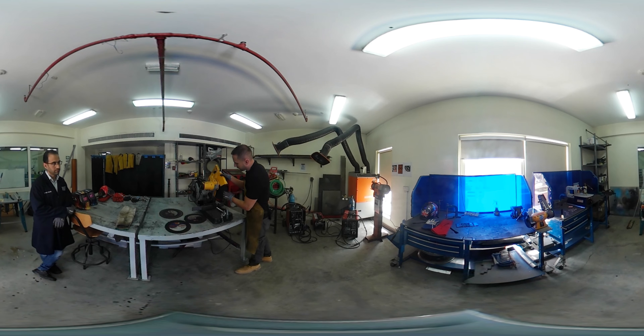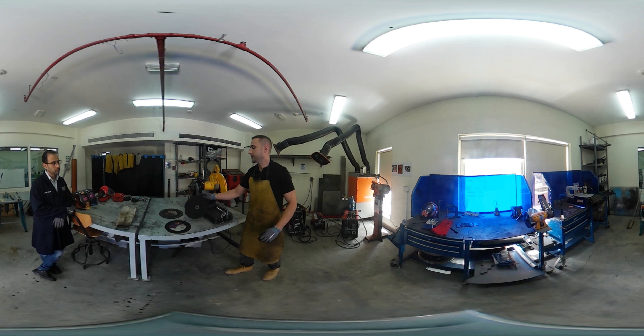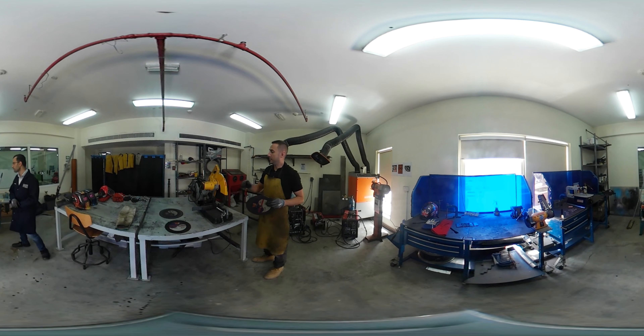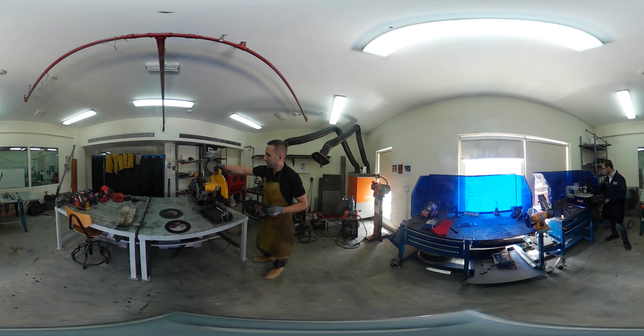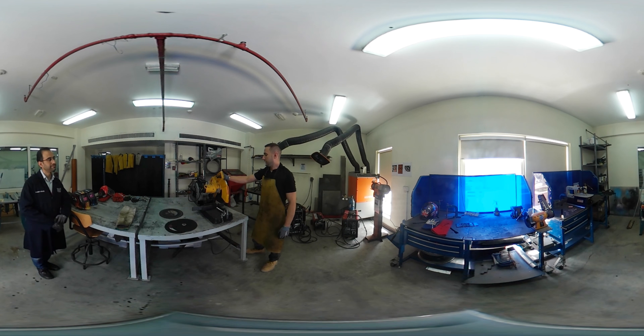Select the disc, make sure it is in good condition and nice and tight. Another example of something you should not do: this crack was caused when the wheel was pulled down too fast and too hard. So when you are cutting your metal, get the disc spinning, bring it down nice and gradually, let the disc do the work, and cut through the metal smoothly.